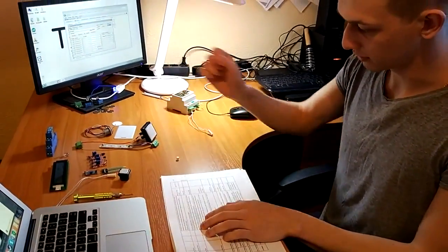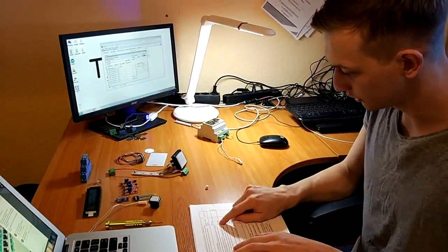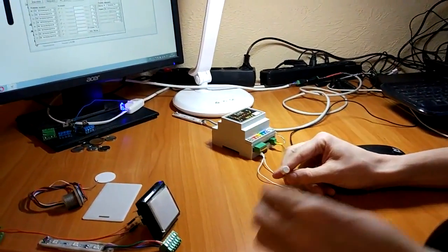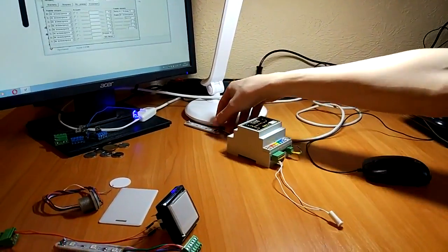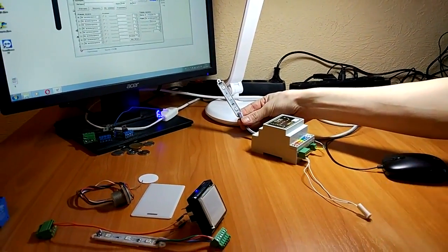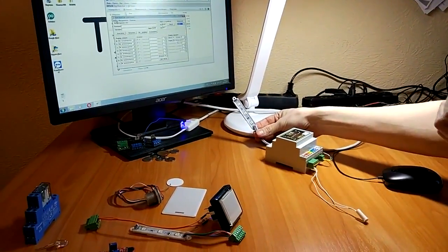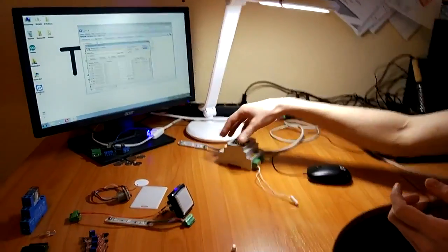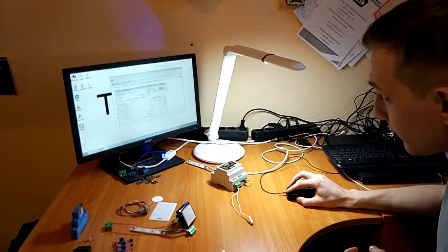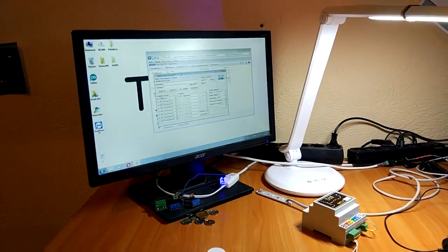Players must find a vase to put on the nightstand, and then it opens. The sensors are a reed switch and a magnetic lock. The input sensor is a reed switch, which responds to the magnet. The output is a diode tape. It is powered by 12 volts and performs the analog of a magnetic latch. If we have power, the magnetic lock is active. If the diode tape is extinguished, the magnetic lock is off.